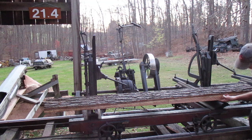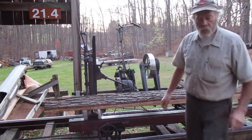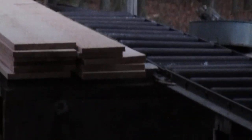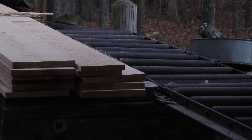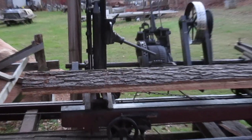And that's 1/4 inch. Now that doesn't mean too much, but one of those boards over there I just cut is totally junk because I didn't face it. I don't know if I can get in on it. It's getting dark and all that stuff. There's one of them over there that's an inch at the top and 1/2 inch at the bottom because I didn't face it. It didn't make a true board, and that was a dumb, stupid mistake. What caused the dumb, stupid mistake is what I'm going to get into next.